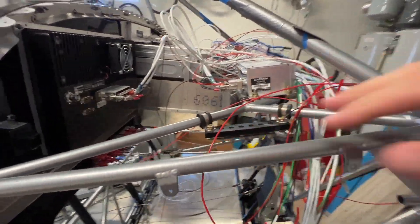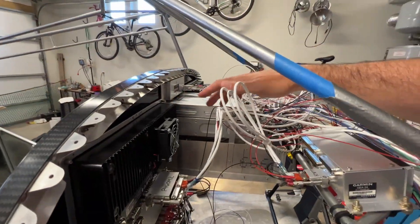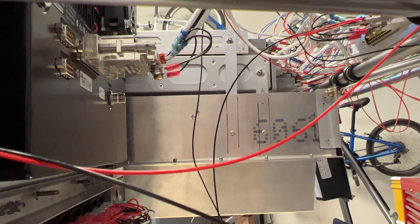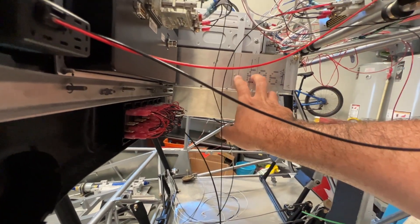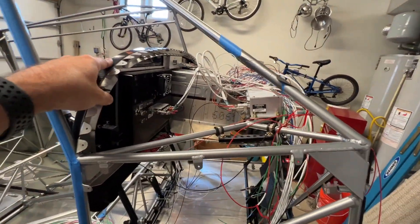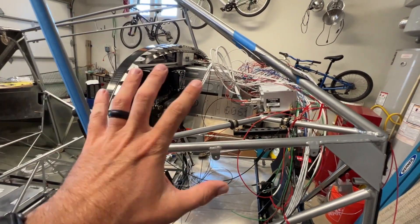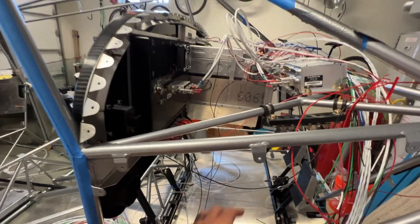We've got the ground bar right here. A fun little project was figuring out how to stabilize and support the rear of the GTR 200 and GNX 375. I just created a couple of C-channels there to support those. There's only one rivet per side right now — that's to enable when I put the top boot cowl skins on, I want this to be able to move just a hair to line up the pre-drilled match-drilled holes right here. Once I get the top skins on, I'll reach underneath, drill two holes, and lock that in with a couple more rivets.